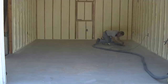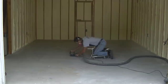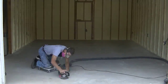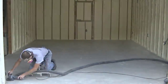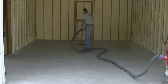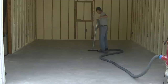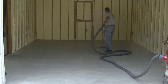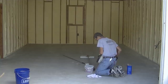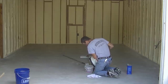For this floor I'm using a simple five-inch Bosch hand grinder that you can get right on Amazon. You can get the shroud for it — the vacuum attachment — and then hook it up to a regular shop vac. You can also use a dust buddy if you want. I'll have all those links down in the description for you guys to check out. Once you get the floor all ground and have the profile you need, just vacuum it clean and you're ready to go.